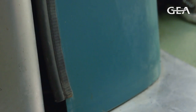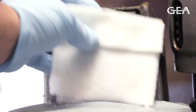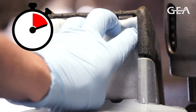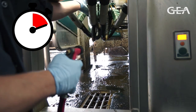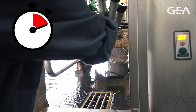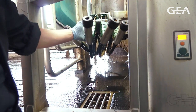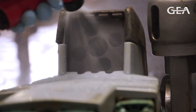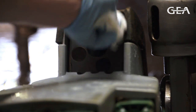Using the AMS descaler, wet a cloth with sufficient cleaner and place it on the optical sensor. Leave it on for five to ten minutes. In the meantime, press the orange button again to lift the milk rack for cleaning the box floor. After five to ten minutes, remove the cloth and rinse the optical sensor with plenty of water. With a single-use cloth, make sure the optical sensor is dry and without streaks.